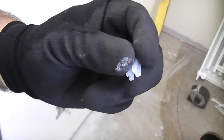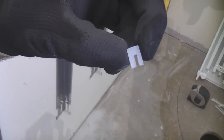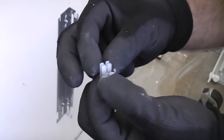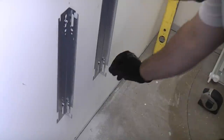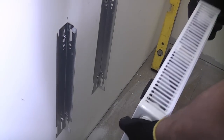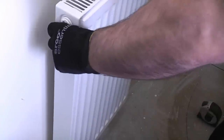We can then take these parts, which are the bracket buffers, and we can place these in position. You do have to ensure that you put these in the correct way up. They obviously go that way, and then the radiator will actually sit in the slot. We can then get the radiator, and then it's simply a case of lifting that on and slotting it in position,